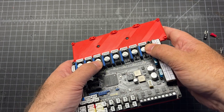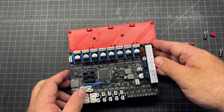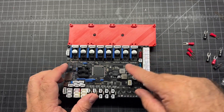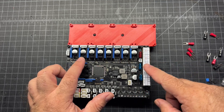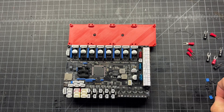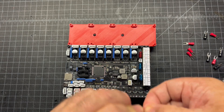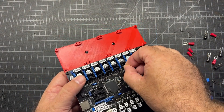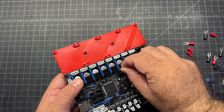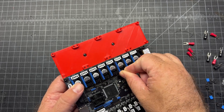Just to check everything: we've got our UART jumper here, here, and here. And we've got four SPI jumpers here. And just for completeness, we're going to go ahead and jumper this one as UART as well, even though I don't know that we're going to be using it - but this is how it was in the manual.